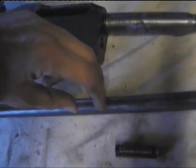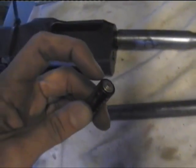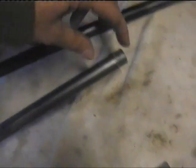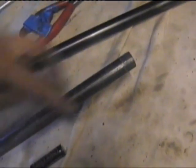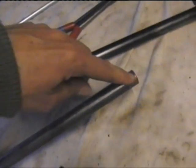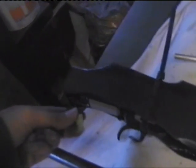inside the pipe, a piece of plastic inside the pipe with a central brass or stainless steel connector connected to a wire, and then have the positive end of these batteries running downwards inside the pipe, and then at the rear end of it we just have a screw-on end cap with a spring or something like that, which screws down on the rear end of the battery, and then the outer casing of the gun will be the negative, like a car. Basically the negative of the battery will be connected to the outer casing of the gun, which will then connect back to the motor, and so on, back to the connector for the motor on the gearbox.